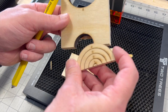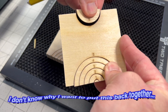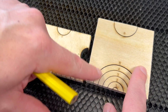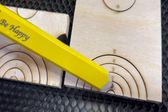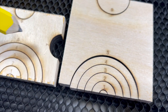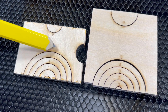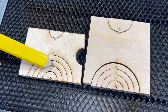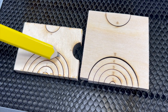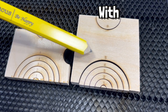We're thinking the real reason behind this is our laser focus area may start to unfocus down at the very bottom, basically where it can't cut down past that unless we move our nozzle down. What we did notice is our engravings and the top of our material is much cleaner on this one. We don't have nearly as much smoke damage to the top of the wood. So that is a key feature of having an air assist — it cleans out the soot and makes it so there's less smoke damage to the top compared to without air assist.